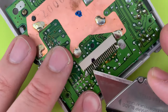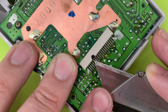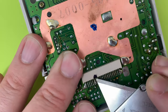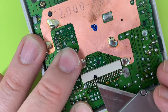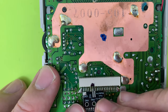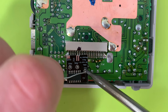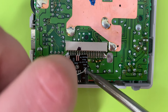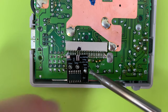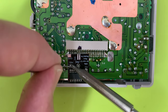Carefully use a craft knife. Pull up the pins from the motherboard while applying heat — I found it to be the easiest way, as I'm really hit or miss with solder wick. Gently pull up those pins, slide that bivert chip under those pins, and let's get to soldering. These three holes align with those three joints where we trimmed the excess wire. Upon soldering the first joint, make sure that the chip is properly aligned with the pins coming out of the motherboard before soldering the next joint, or else you're in for a tougher time.